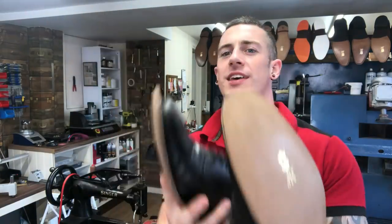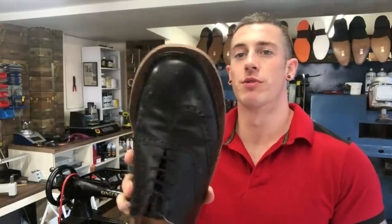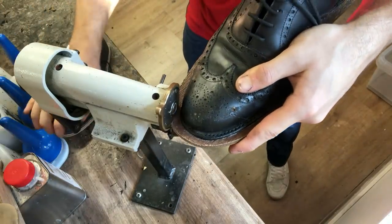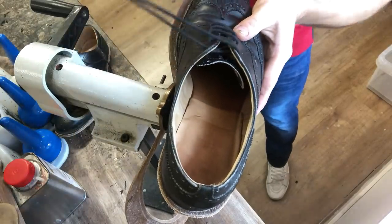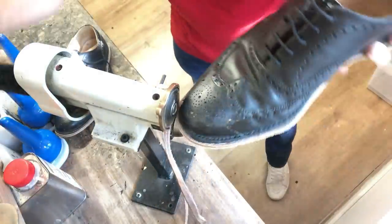Our soles are nicely on but there's a little excess - the soles put on are just a touch too big. To remove that excess, we head to a tool called the Ranger. You can cut around leather soles with a knife but if it's particularly tough like JR leather, it's easier to use the Ranger, which is a crank-driven blade that just chops off the excess. We're careful not to chop the laces off! Then there's still a little bit left so we head back to the machine and sand it to a smooth flat finish.